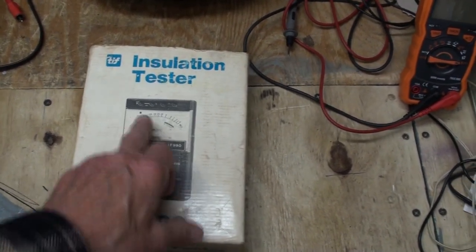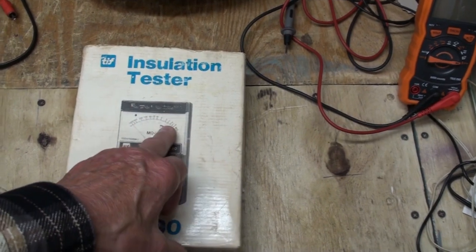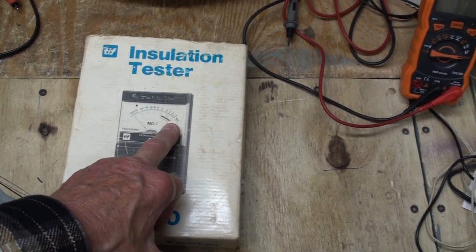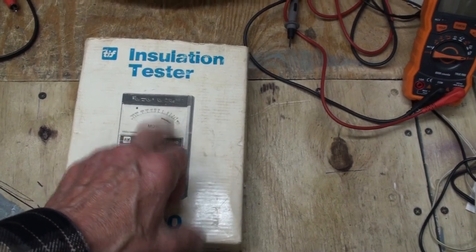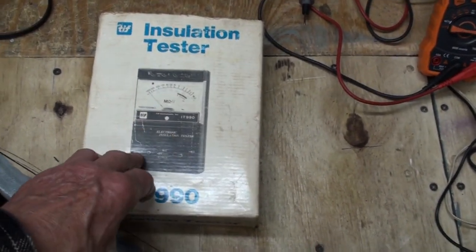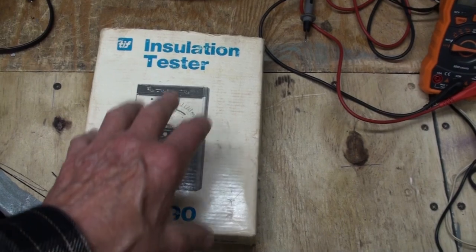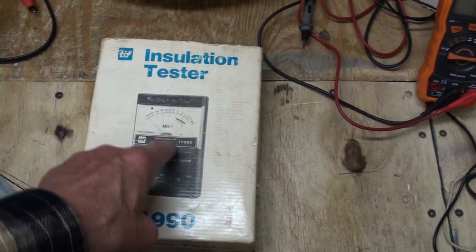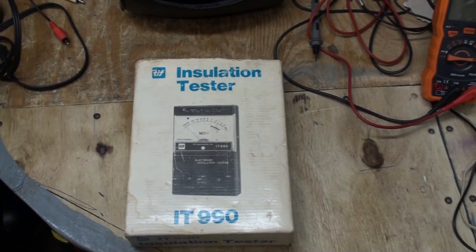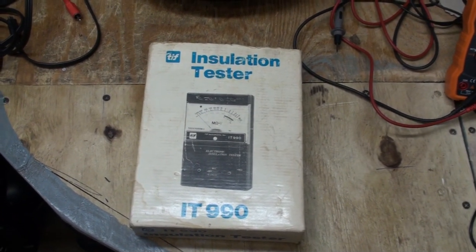Now, I'm going to try to identify the polarity that's going to be on pin 12. If I don't get my positive voltages on pin 12 on this circuit board, and negative on, what is it, pin 7, I don't recall now, but I have the pinout for the TL494 chip anyways. So I'm going to do that on this video, and if that all proves to be okay and the transistor isn't shorted, which I'm going to try to find out on this video, fine.